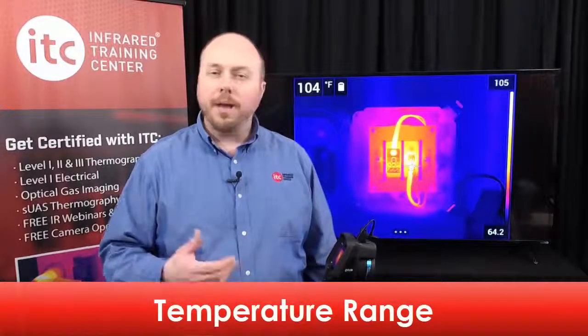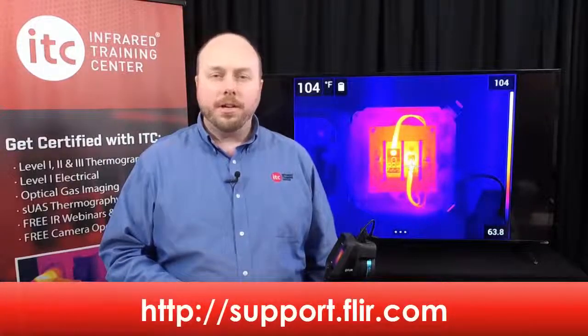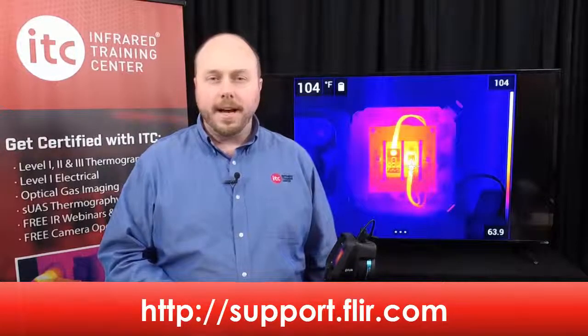The range covers an interval of temperatures that the detector is able to accurately measure without going into saturation. Depending on the model, some infrared cameras have multiple temperature ranges that can be utilized. You work within a range, and when saving an image, all of the temperature data in that particular range is captured. To see what ranges are available on your camera, once again, please refer to the datasheets available on the Flir support website at support.flir.com.